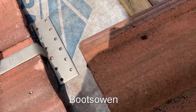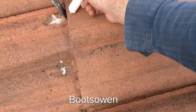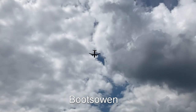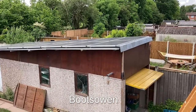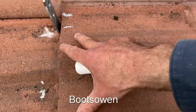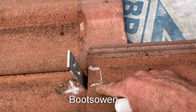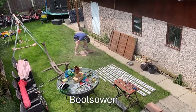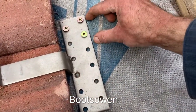Marking them out is what I wanted to talk about. Take the tile you're going to cut, slide it back down to roughly where it'll be in the greater scheme of things, and just mark out where you're cutting. We've done this a few times already on the central bits. We need to take it back about an inch, roughly — probably less — but you want to give yourself a bit of wiggle room. I'll make a video from up here of Andy grinding it, because that suits me to be far away from the noise of the grinder.